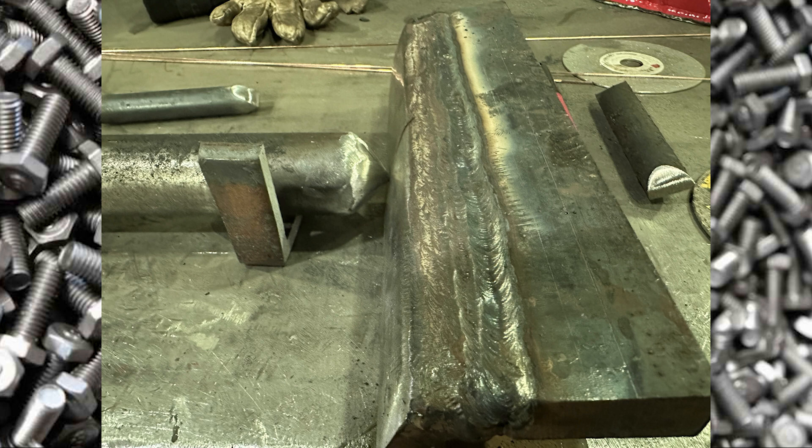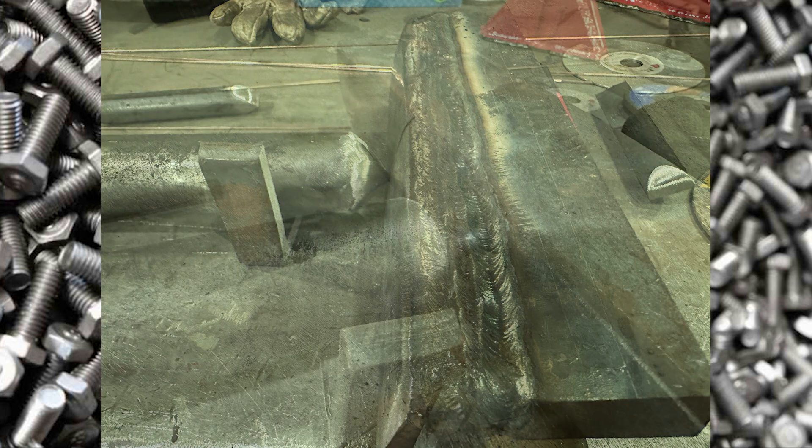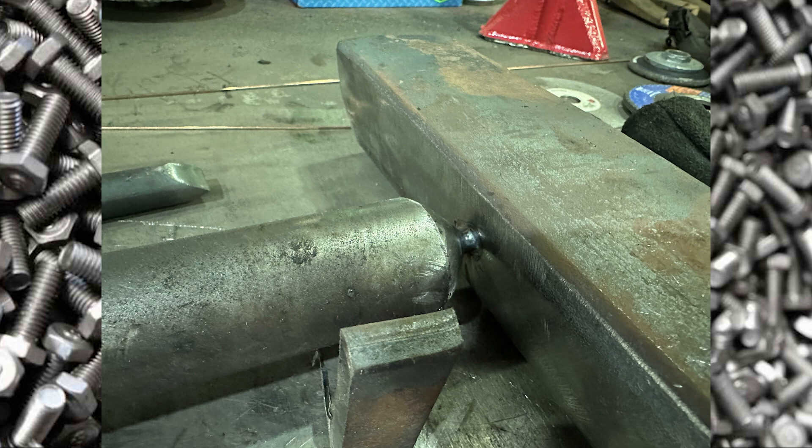This tool is going to be excessively heavy and excessively big. Welded tools for jackhammers aren't really made that way — generally they're one-piece forgings, which are lighter and stronger. I don't know that a one-piece forging exists for what these guys are doing, so this was the best I could do. I TIG welded it all the way around and let it cool, doing a pass about every 15 to 20 minutes between other jobs so it wouldn't get too heat-soaked.